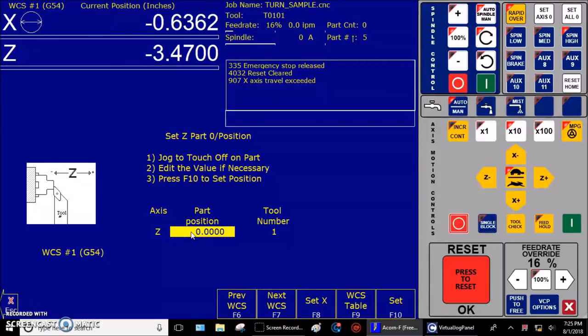I have both fields set. Step six says press F10 Set. You'll notice the part zero is now set for the Z axis, and the Z axis DRO will now display the part position of the skim cut. This makes perfect sense — my tool is physically sitting at my part Z zero point, and now my DRO for my WCS shows zero for the Z position. The last step: carefully jog the tool to a safe position away from the part. Now we're going to get ready to set part X zero.